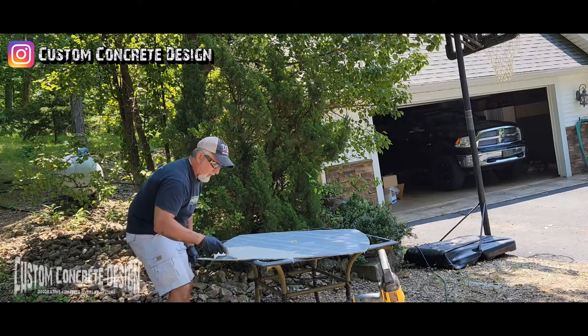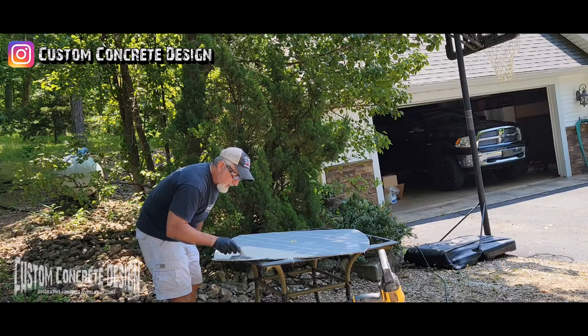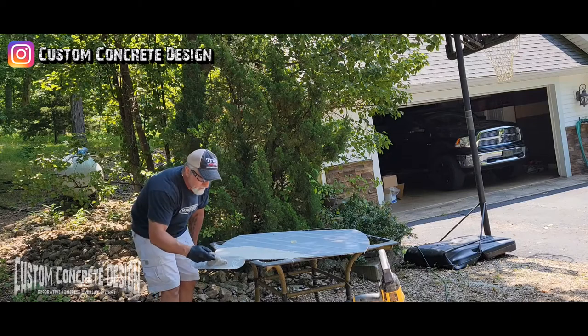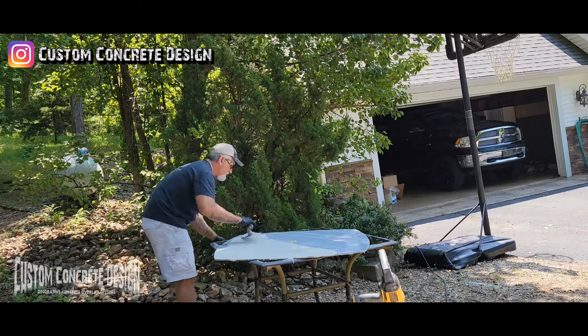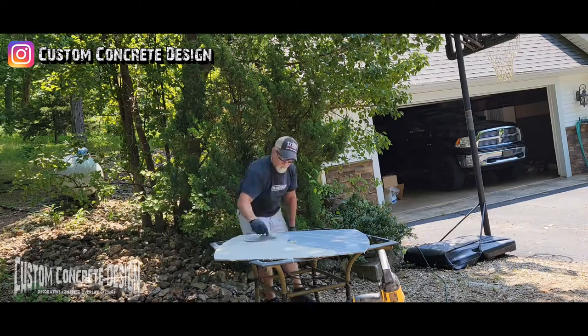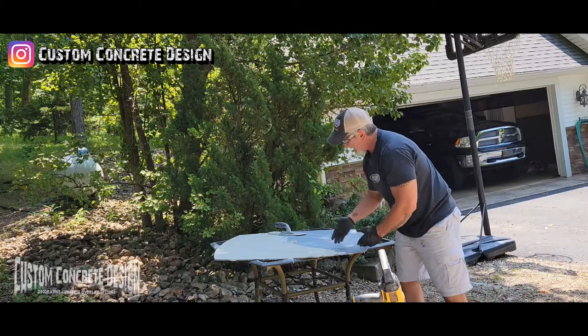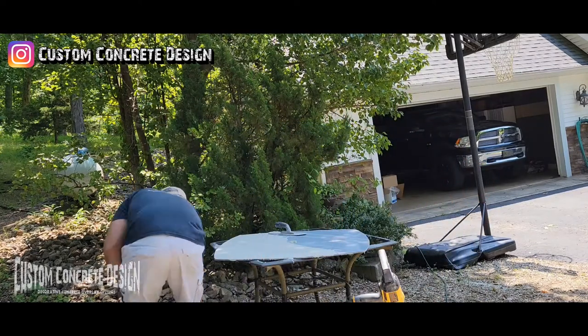And, you know, we want this to go on thick. So we'll make sure we got our joint lines covered up, because there is a little bit of buildup of concrete since we covered them. If I didn't have that tack coat on there and I'm raking that concrete across that line, it's going to go right up underneath that line. Right up underneath that tape.